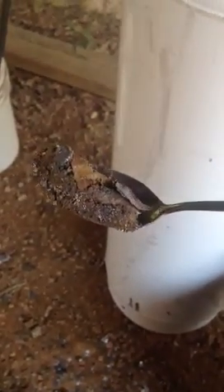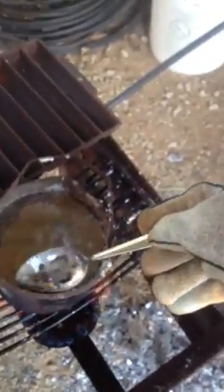I use a stainless steel spoon - just run it along the edges and you can see the amount of crap. All that dirt and everything else just from that lead. I've got a designated spot where I drop all my dross and scoop it up with a shovel about once a week. I'm running a little hot so it melted quicker. I'm just casting ingots so I'm not worried about the temp too much - if I was casting weights I would drop the temp.